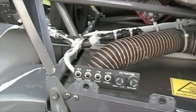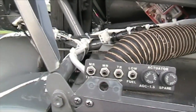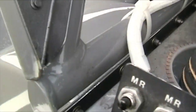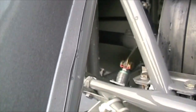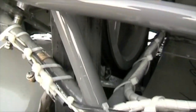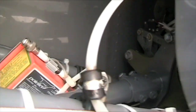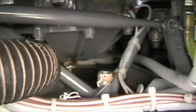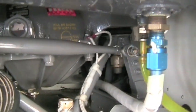We're going to check the frame. From this deck up, it is considered the upper frame. Looking for cracks in the welds, in the tubing, any corrosion, rust, deep scratches — really anything that doesn't look right in the frame should be checked out. This frame goes all over the place. Just follow it up and around — it connects all over the place. The upper frame connects down to the main rotor transmission and goes down.